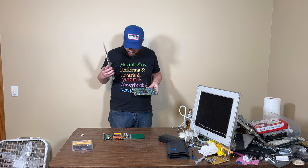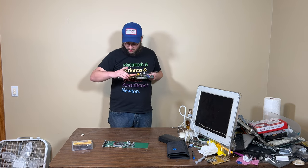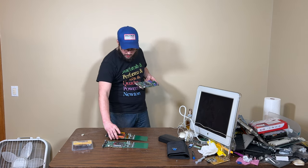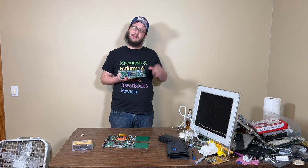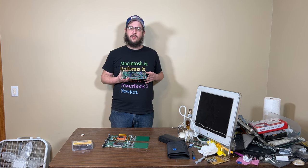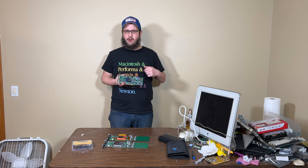The problem is the chip on these, at least some of them. This one, I think, is different than this one here. I have a lot of these Ti4600s. This has the same chip on it. That one doesn't. So some chips were easier to flash than others, probably. This one you should be able to plug into a PC and flash the firmware straight onto it. The problem is the chips are kind of crappy and it will fail a few times, but it should work. The better solution is to put it in an EEPROM reader and just flash it. And it will probably fail a few times, but it will eventually flash. That's what we did. So you take it off the board and you just put it on the EEPROM reader. Flash the Mac firmware on it, it's done.